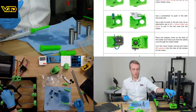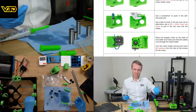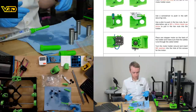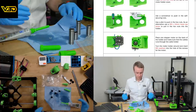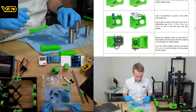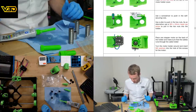And that ends up then scratching into the rail. I mean, these are hardened rails, so maybe it wouldn't scratch it, but they would slide, and that would be more noisy than if they would roll nicely. So there is a balance to be had. If it's not viscous enough, then it will just disintegrate or break down quite quickly and not last very long. But if it's too thick, it can actually have the opposite effect. But I've used this on printers as well, and it seems to be a good balance.